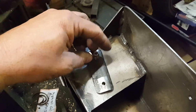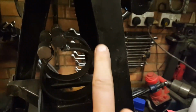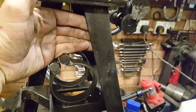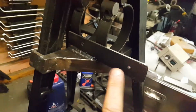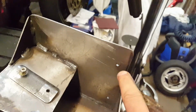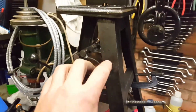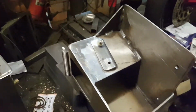You'll see this when it's assembled in a minute. They go on there, and that clamps to this here to hold it here. Clamp, no alterations to the saw, and the rear bolts that you see fit onto here and here. This also helps to keep it level. The holes in the rear are a lot bigger than clearance, 4-5mm. The reason being for that is to allow that bracket to go up and down as you please for chain tension while this still is flush with the top of the saw.